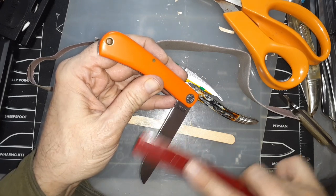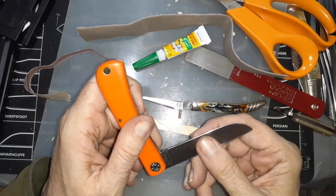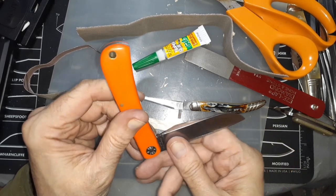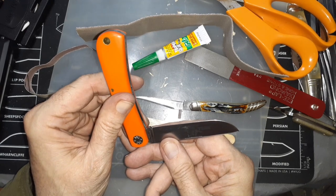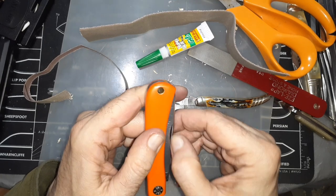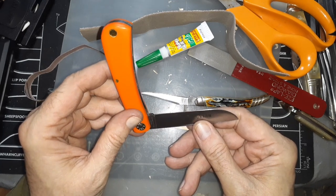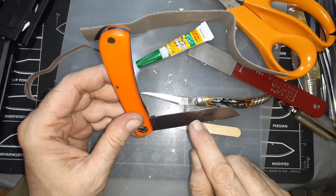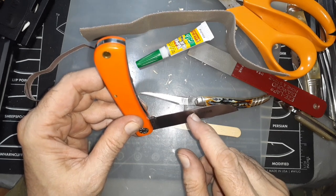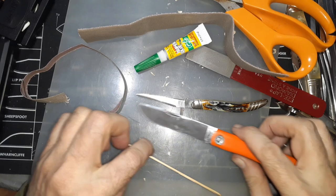I notice these things have more of a convex edge than a straight flat grind like from a belt grinder. Then I look at the edge — it's best to see it with a good light — and let it drop. This one's got such a strong drop you don't have to push it. Then check the edge again. You're looking for any reflection right where it should be. If that shine doesn't stay consistent, you've probably got it. That's it — fixed on this one.